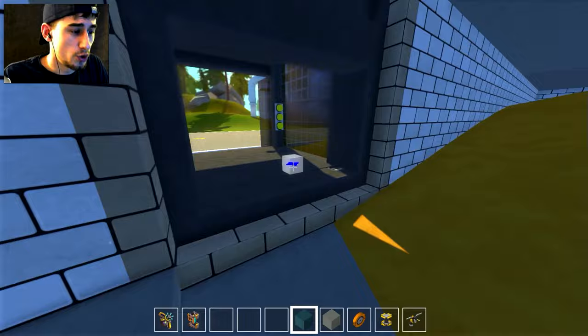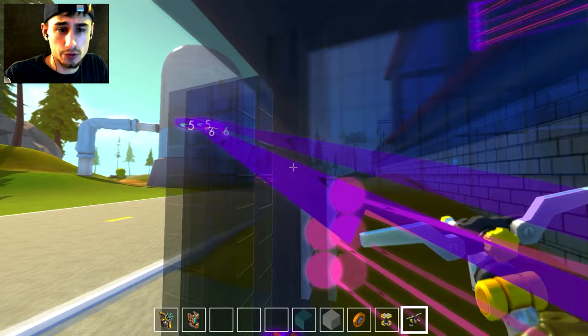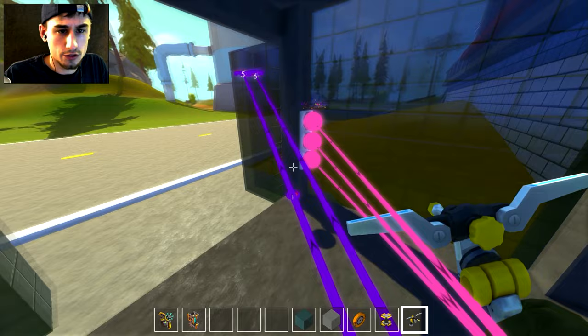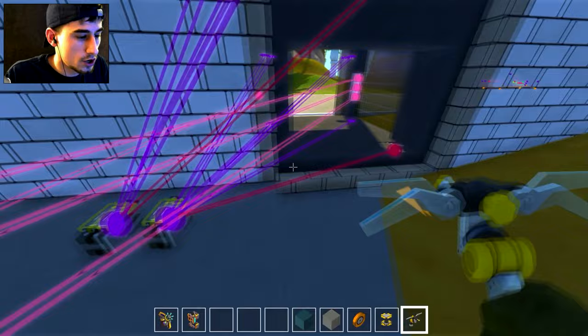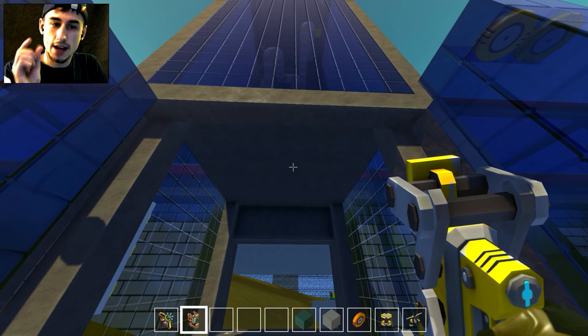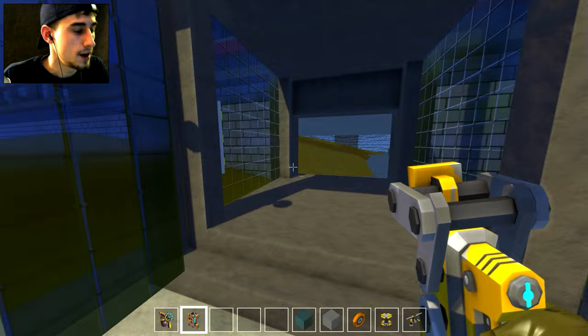The elevator circuit is quite cool. The doors on the outside are actually painfully simple — there are three sets: the roof ones slide, the second floor has one that slides open like the whole wall, and the bottom one has accordion doors for space. The doors are just hooked into floor sensors — a sensor senses when the elevator is on each floor. The doors have a tiny bit of a time delay so that when the elevator is passing through the second floor it doesn't cause the doors to open and close. When the elevator gets to a floor it waits a bit, then the doors open.